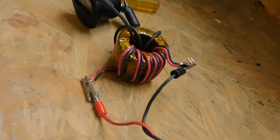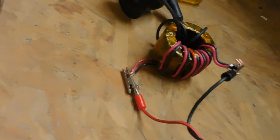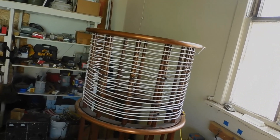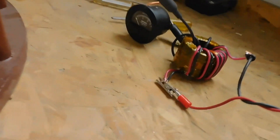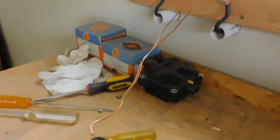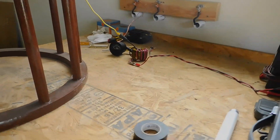The primary side of the transformer goes to the ham radio side — that's the red and black leads. One of those leads goes up to the bottom leg of this Tesla coil, or extra coil if you want to describe it that way. The other lead goes to an RF amp meter, which goes to a ground lead connected to a pair of very large former fuel tanks buried in the backyard.